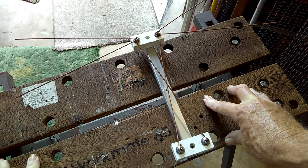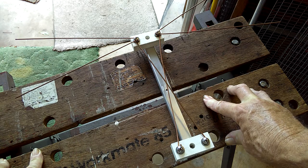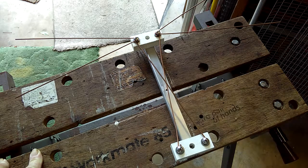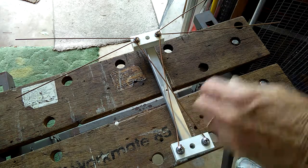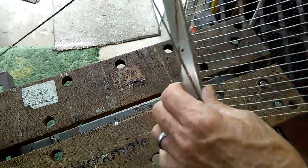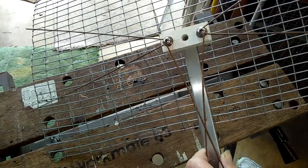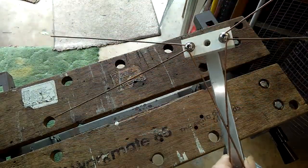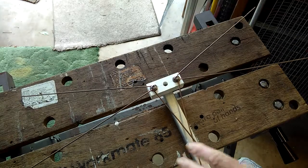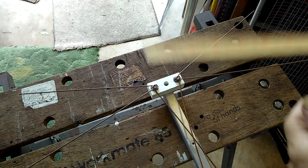It's not the most stable as far as maintaining the signal in the thunderstorms or heavy wind or through the trees, but you can put a reflector behind it. You can go 5 inches behind and add some kind of reflector material, and it'll stabilize it by reflecting the signals back. But this is a nice little antenna. It's very simple. The dimensions are simple.